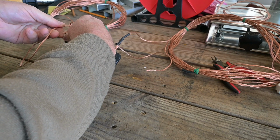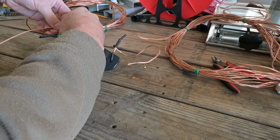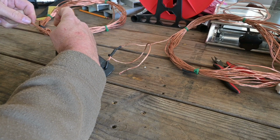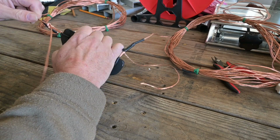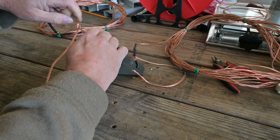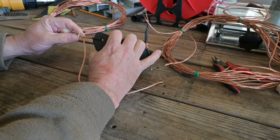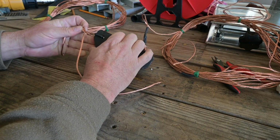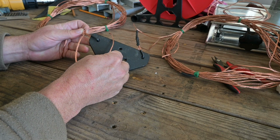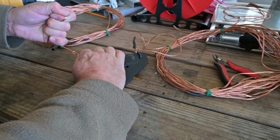Now we take our free end, run it back through here, and pinching here, we just pull this back through, and our knot is complete, just like that. Tighten it up, inspect your work. We have an outside bowline. The nice thing about using the outside bowline in this application is this is going to allow us to tie into our feed line.